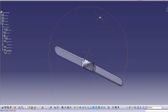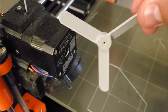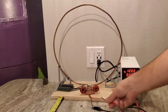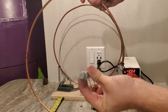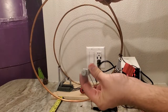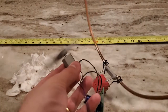The first DC load I wanted to try was a brushed motor, so I designed a 3.5-inch diameter prop and made it on my 3D printer. I eventually want to fly a drone with wireless power, so maybe this would provide me with a little bit of insight. Even though this was a tiny motor with a propeller that was nowhere near optimal, it generated a surprising amount of thrust connected to the receiver, and I could actually feel it pulling on my hand just a little bit.